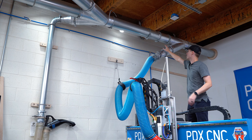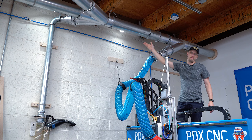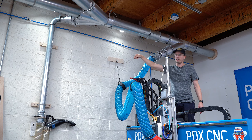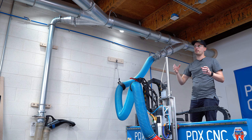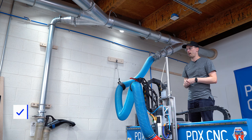One consideration here is the bigger your duct is — and this is all Nordfab — the more expensive it is. So to make a 90-degree turn right there would cost more. But ideally, take your trunk line as far as you can before you reduce it to the final size.